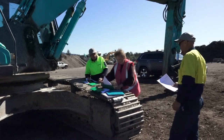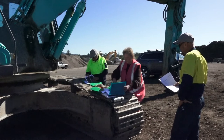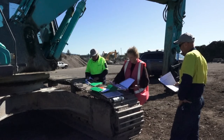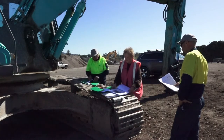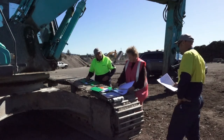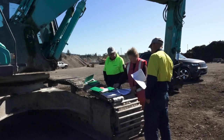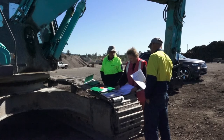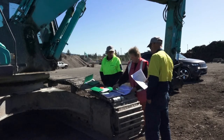If there was to be a flame, hydrogen being such a light molecule, it will rise up into a candle. I can share these pictures with you. It will not spread out. Storage and venting, as we talked about. It will not spread out in a wide spread. Hydrogen will candle upwards, which I can show you through here.